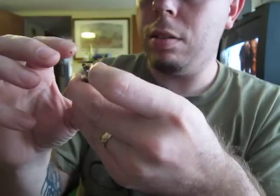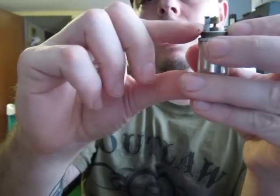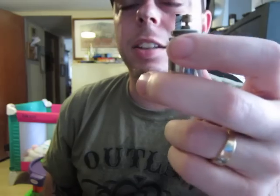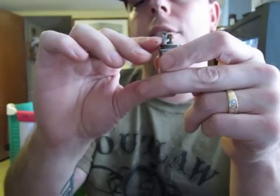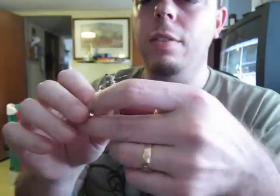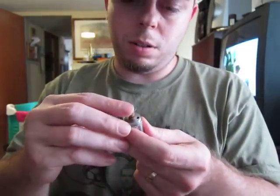This is actually what I found to be the best way to do this — no shorts at the top. If you do have a short at the top, which is most common, go down below. I mentioned this in the forum: if you have a short in your coil it's generally going to be at the top or bottom. Just picture the electricity going through the coil like a water hose — wherever it stops glowing brightly, go down past that; that's where your kink is. Bump the wire just a little bit to even out the flow of electricity. I've got quite a bit of wire hanging off, so I'll just leave that until I burn the paper off.